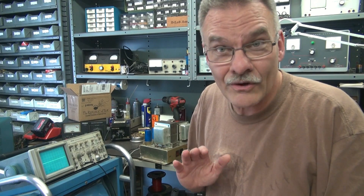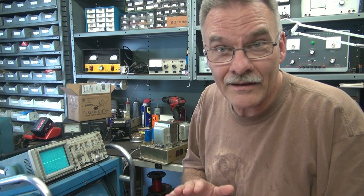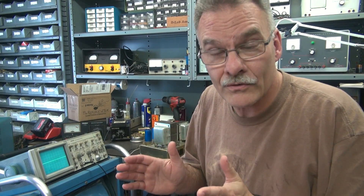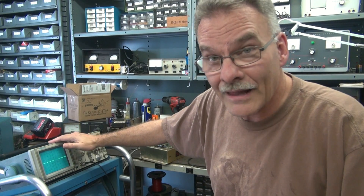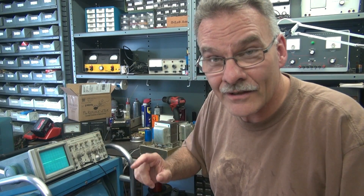Piece of cake, huh? Well, sometimes I do get lucky. However, if you notice in this video and my previous videos, I always look for the obvious. And when it comes to old tube amps that have served you for 50 years, there's going to be things that are worn out, there's going to be bad connections — so that's what you look for first. The other big piece of advice: get yourself a scope. It doesn't have to be a really good one, but it will allow you to see things that you can't hear. It's a very good investment, and you don't have to be a rocket scientist to operate one. Hope you enjoyed the video.